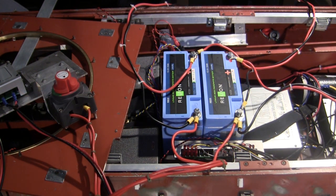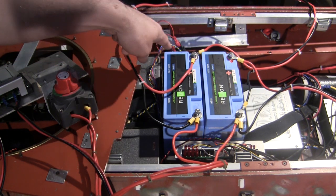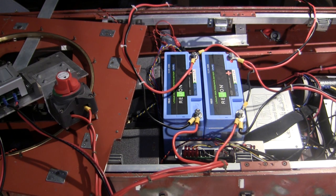To start this video off, we go back to the power supply that we have here. Like what was stated in an earlier video, the tank is 24 volt powered, and the way you achieve that is you take two 12 volt batteries and you hook them up in series circuit, thus giving you your 24 volts to operate the model.